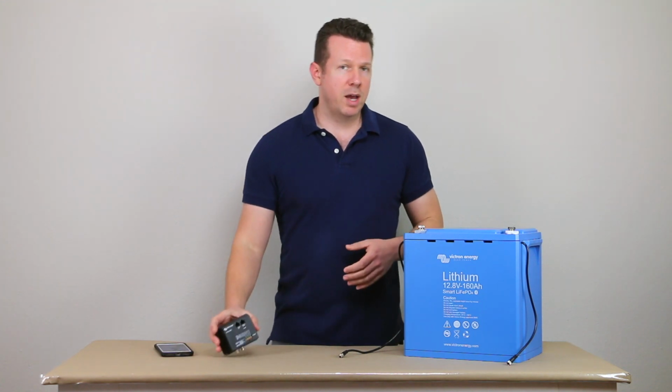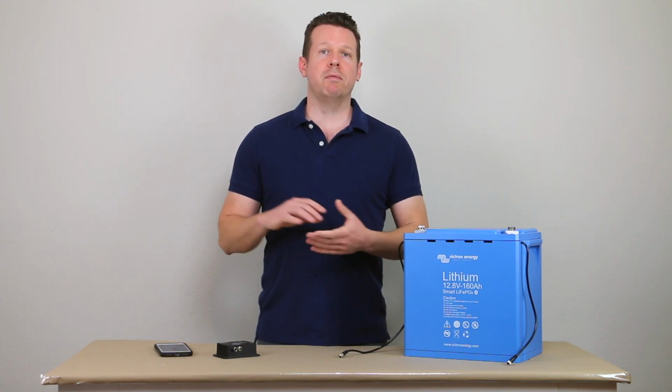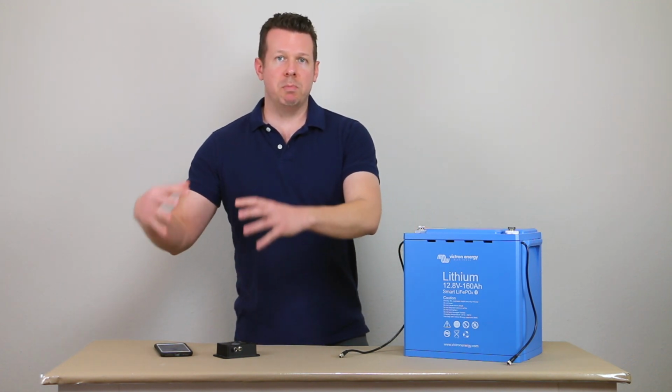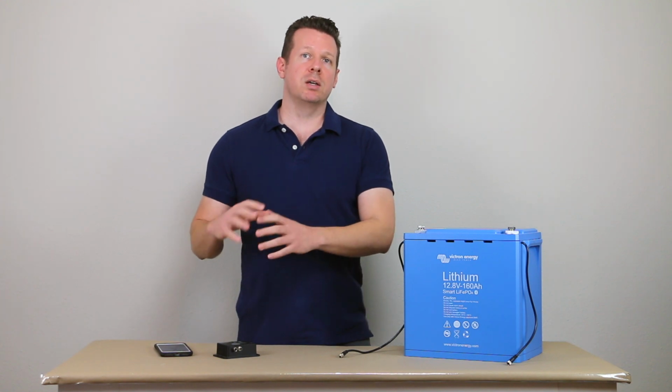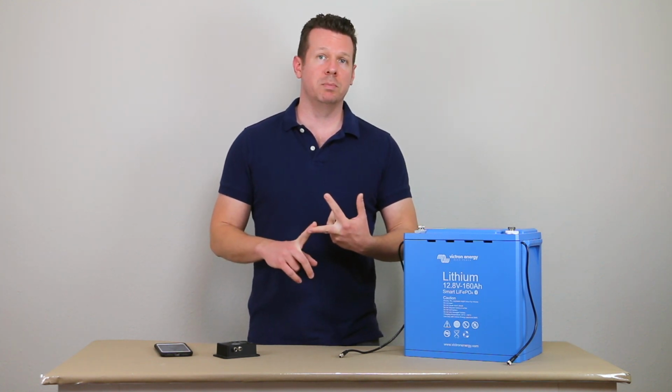Now, in contrast to that, if you feel like this video is too involved and too difficult, then you may be a candidate for the built-in BMSs, where you just drop them in and they are going to disconnect from the greater system in an adverse event: over voltage, under voltage, or getting out of their acceptable temperature range. So that would be like the Victron Super Pack, Battleborn, Trojan Trillium.